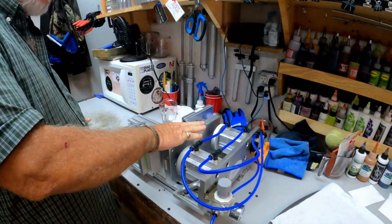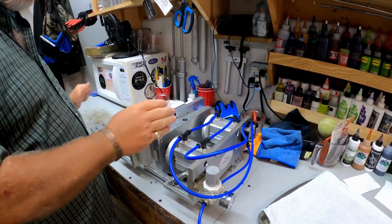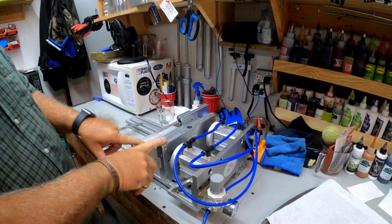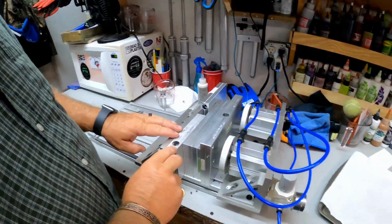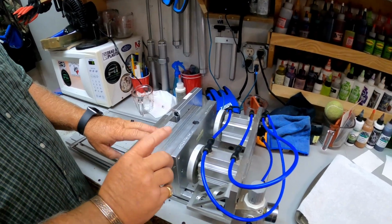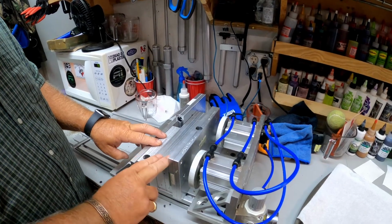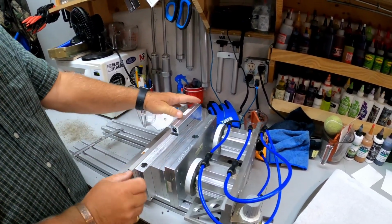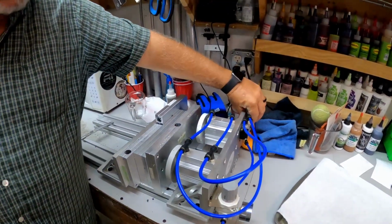Okay, this is an air vise. It's an air clamp. It holds all your molds together. Now I have it set up. We're only going to shoot these 2 molds, but the way I've got it set up, I had to use some spacing in order to get a good clamp on there, because this mold is lower than that mold. So I just added these 2 molds in there at the same height to give them my spacing right, and put that over there so I get a good clamp, so when it shuts, everything is nice and tight.